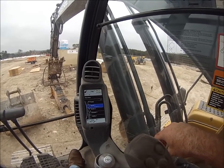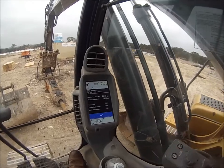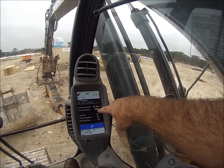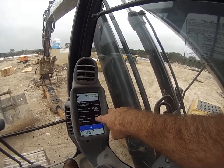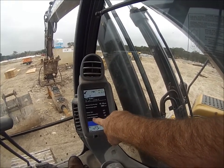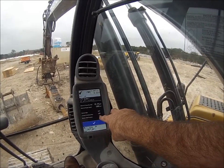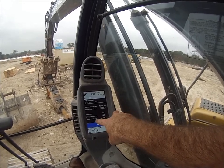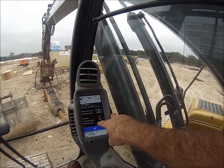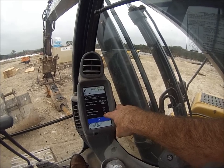It gives you the maximum pump flow rate, the engine speed, selector valve, and the relief pressure. This setting is kind of important when you swap attachments — it should be on. There's another setting where it would be off, and that's the one you don't want, because with auxiliary hydraulics it's a pain to remove and reattach hoses.